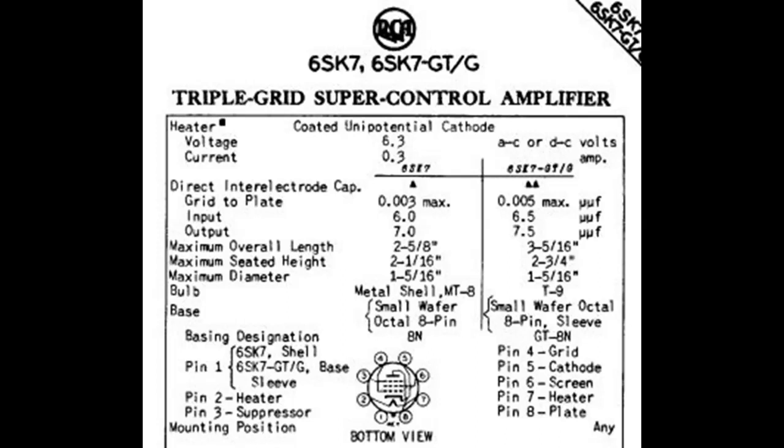So if you have any noise in the radio, you could very easily get noise in your signal, a little hum in the background or something like that. That could drive you crazy checking, especially if you changed all the tubes and put in exactly what was in there, figuring those were correct. So it's kind of like, pay attention. If it calls for just plain number tubes, those are almost assuredly the metal tubes with the built-in shielding, and that's what you want to replace them with.